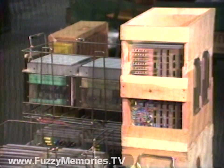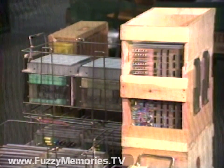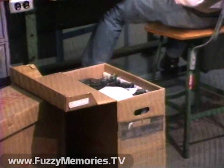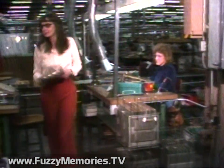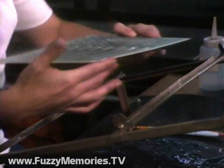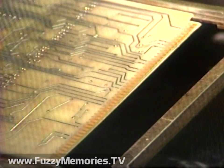Minimize handling. To do this, keep parts in their original containers whenever possible, and return the card to its proper container as soon as completed. Use protective bags or protective containers for storage and transport of components and assemblies. Hold static-sensitive cards and components by the body or by the edges — never pick up a card by the components or touch the contact tabs.